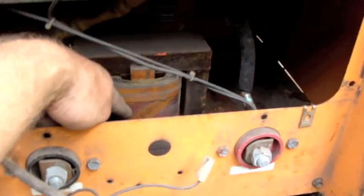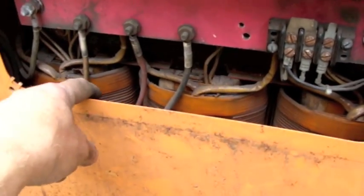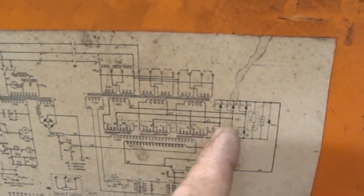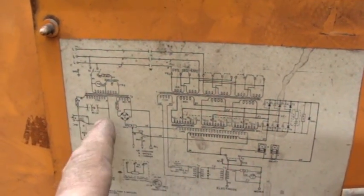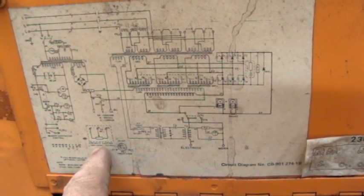In the front here we can see a transformer - that's all copper, so you've got some money there. But the real money is right back here: this big transformer with three big cores, that's all copper. That small transformer in the front is the control transformer. On the schematic diagram, this is the big transformer - you can see all the different windings. The control transformer is tied in and has a secondary that creates DC which is then controlled variably through the remote variable amperage control.